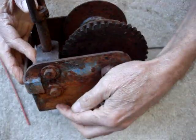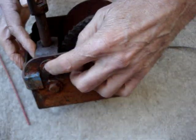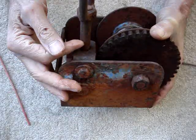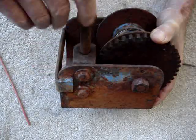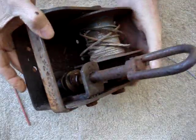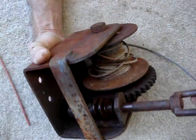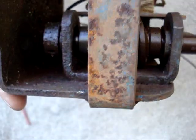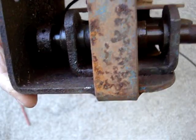Then I come back, turn the hand crank to take out all the slack, swing the worm back over to correct engagement — pivoting down at the pivot point — then either put the bolt back in or use the retainer pin, hook, or flip latch to hold the worm engaged. The worm moving up and down is what I call mentally disturbing — that's not a good thing.